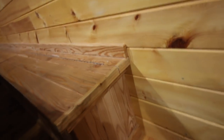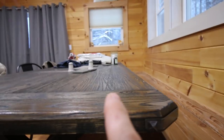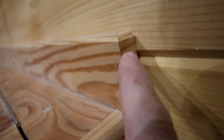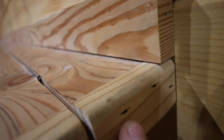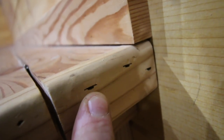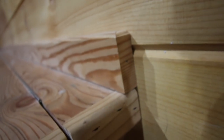Here's a perfect spot to show you the two different nails being used — on this bench we made for our kitchen table. Right here in the trim work you get the tiny little holes from the brad gun when you want small nails. And here where I needed a bigger, heavy-duty nail, that's what the finish nail gun leaves you for a hole. So if you're trying to cover something with putty or paint and want it filled in, you can either have a bigger hole like this or just a small hole that the brad gun gives you.